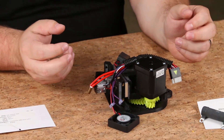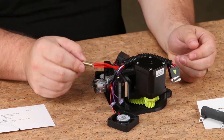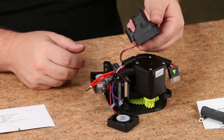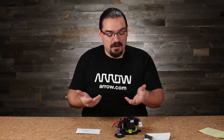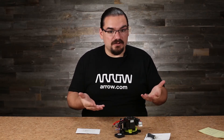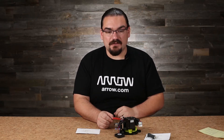This is an excellent demonstration of what heat sinking can do. We're putting almost 10 times the power normally meant for this resistor through it, and properly heat sinking it into this large hot end, which actually has a small fan to cool it off at the top so that you aren't burning things out. The reason you don't want to use a 10, 20, or even this big 25-watt resistor is that you want the resistor to output heat. One of the byproducts of resistance as you pass current through it is heat — we put a bunch of current through it, a bunch of heat comes out, and we use that heat for good things.